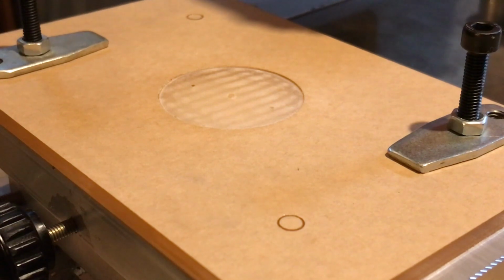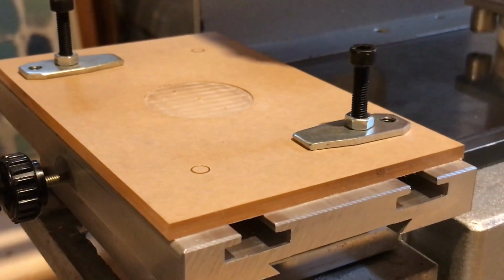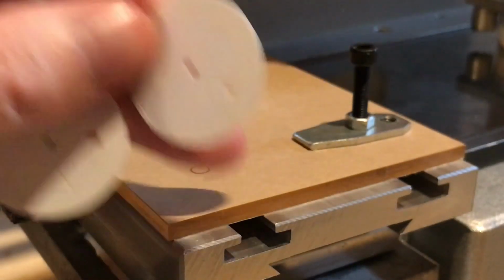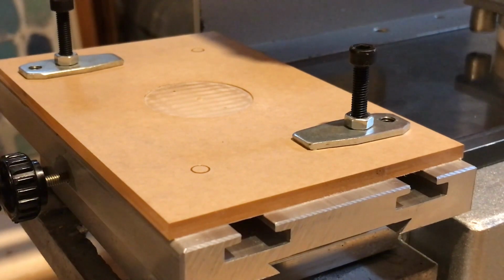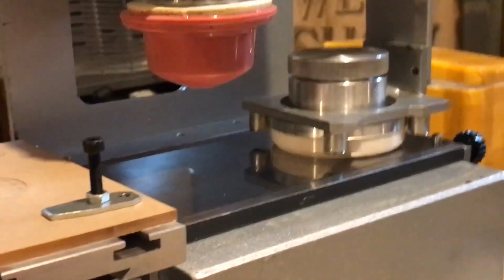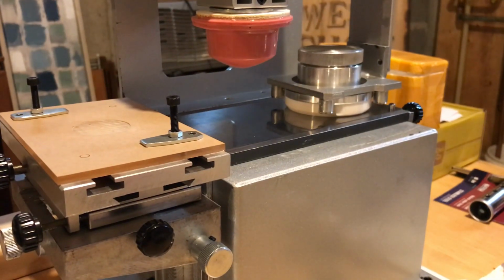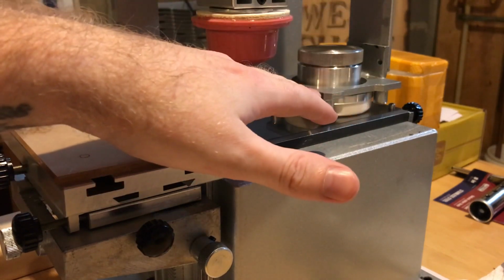That's the fixture. You have to have something that can be attached to the pad printer, stay in place, that you can tweak and move on the surface so that you can get it nice and centered. And then having lots of testing dials or testing blanks for making sure it's printing exactly where you want. Then you can put your final dial blank on it to print. So for example, I might print off a lot of these plastic dial blanks, but then the final dial blank I put in there for the actual production watch I'm making might be just a primed metal that's more sturdy and solid than a 3D printed PLA plastic. So that's the fixture. Again, the pad, the ink, and the plate.